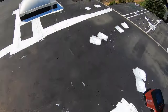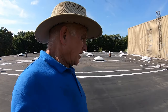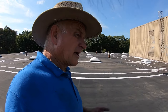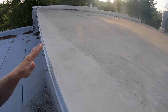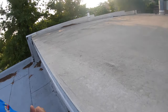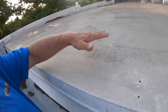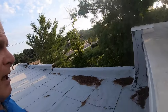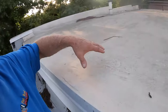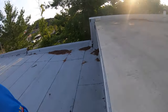I'm going to show you clips of roofs where silicone was sprayed over an old asphalt roof — amazing. The same product. As I told you, it gets this color because of the asphalt bleeding through, that's why it's brownish. But this has been up already seven or eight years. I want to show you how good this silicone works on asphalt, on EPDM, on metal.